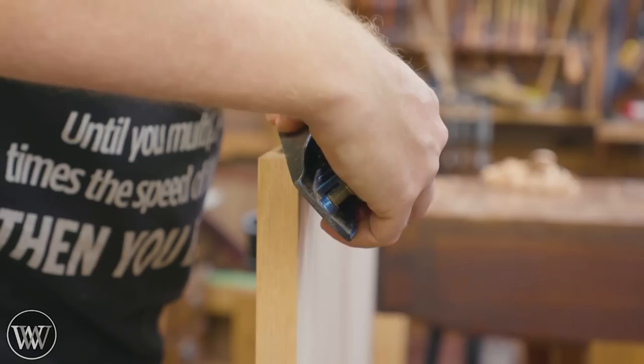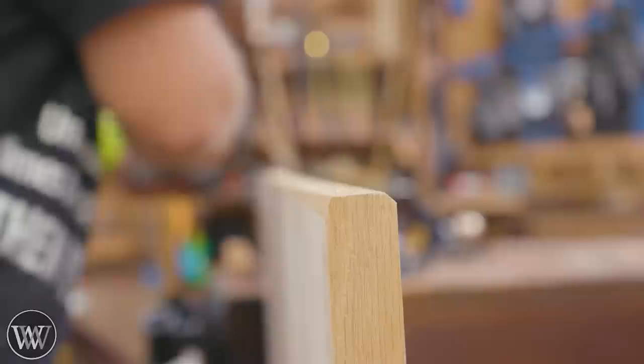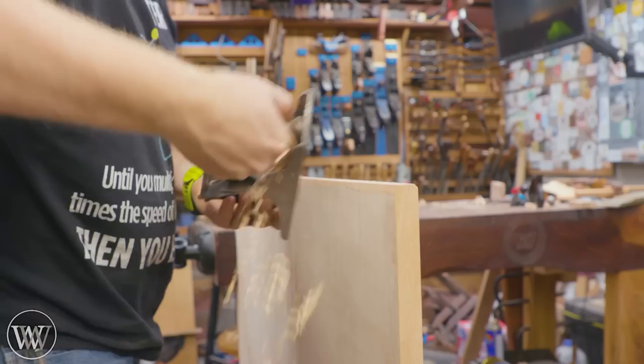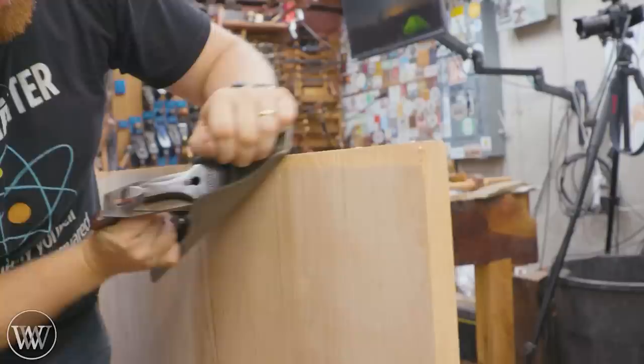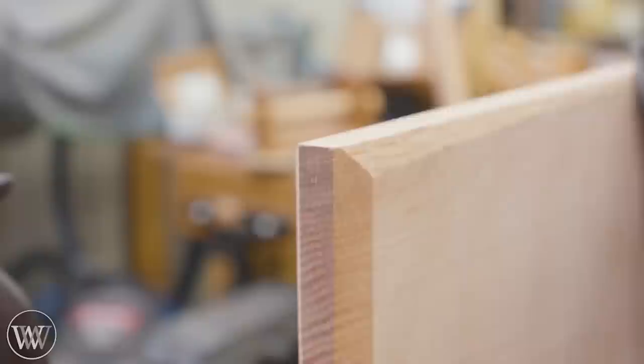It's at something else. When you're doing the end grain of the table, it's actually easy if you just skew the block plane a little bit. In this case, I ended up going with the regular plane, and then I think I switched to the low angle plane just because it was easier to handle at that particular angle for this one that's not 45 degrees. The one that's 45 degrees, the block plane did perfectly fine, but in this case, it was not. Actually, no, I went and used the aluminum plane. It was rare. I actually used it because it was lighter. I could handle it easier at that weird angle. And so the aluminum plane worked very, very well for that.